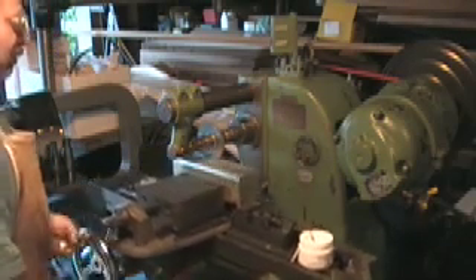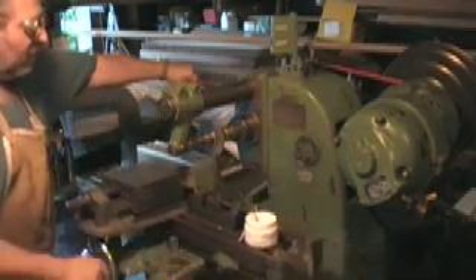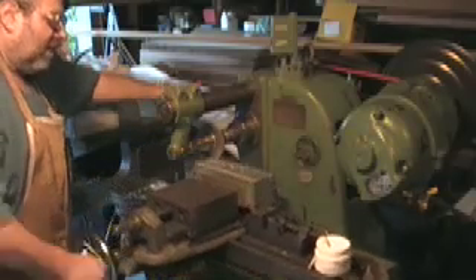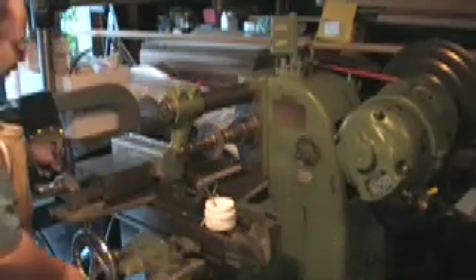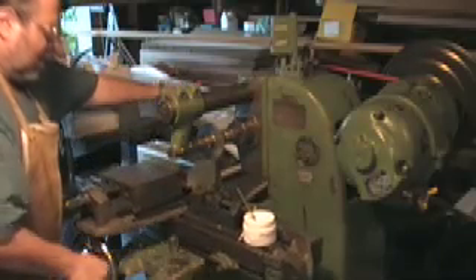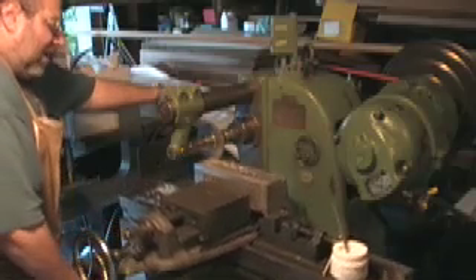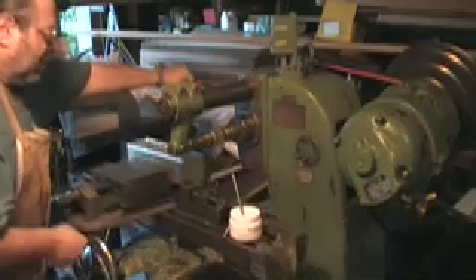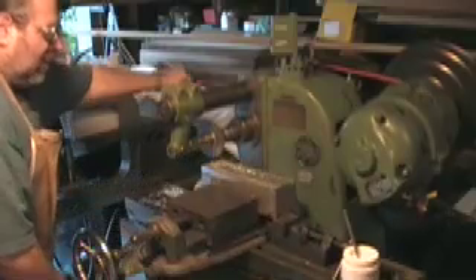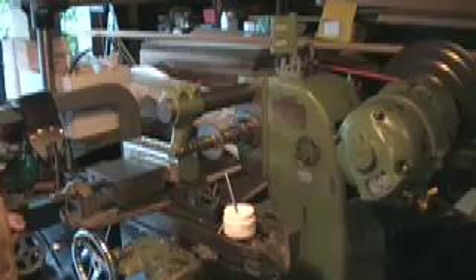I make a cut, lift the head, reposition, move it down, clean the cut up. This is a pretty decent cut — I'm taking 10 thou off. We chomp through 10 thou like nothing. Lift, reposition. I've taken three cuts in that slot in just a few seconds.